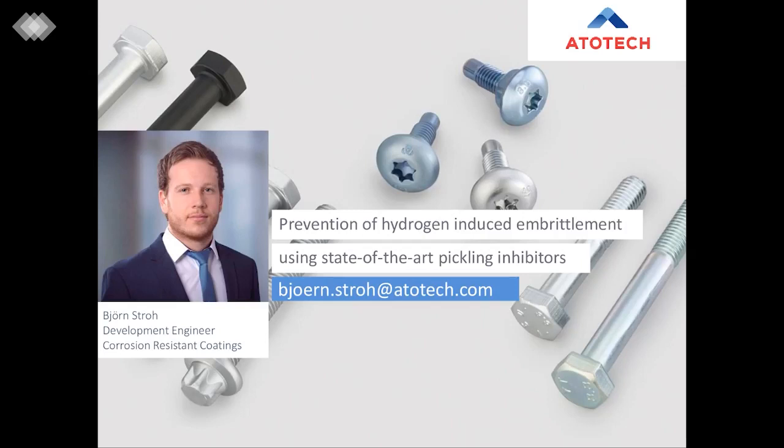Thank you. Next question. Does the inhibitor affect plating baths if it is dragged in? I think in general, this is obvious, we should say that drag-in from one position to the next is always not optimal. However, we tested this and we saw that there is no negative effect when inhibitor is dragged into the electrolyte.